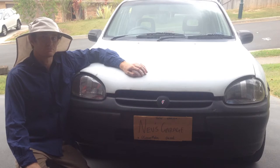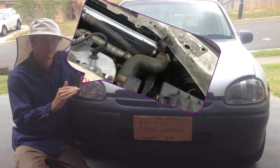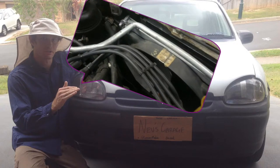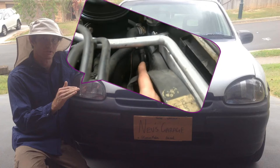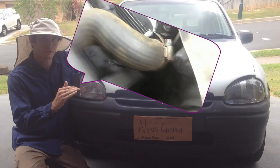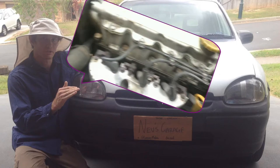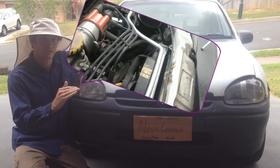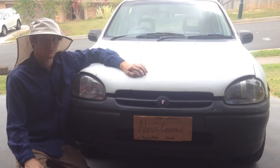They're really unique in their coolant system design in the way that both the inlet and outlet pipes of the radiator are very close to the top and they're almost parallel. The right-hand side hose is right at the top of the radiator — it's actually higher than the radiator. And the left-hand hose is down from the top about 3 inches. So you have all this tank and the whole block which is below those hoses. So if you just take a hose off the radiator, or even if you drain the radiator from the bottom, you're going to have very little coolant come out, which makes it very, very difficult to drain the coolant.